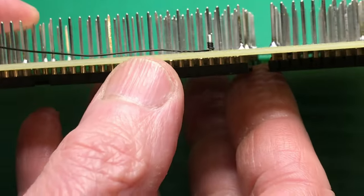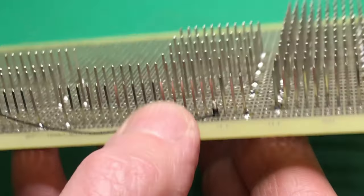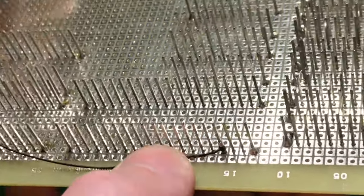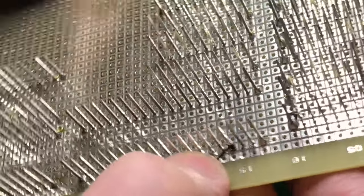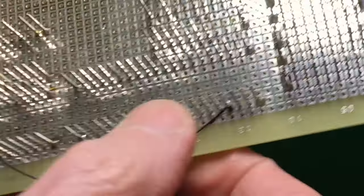And just four turns of wire, which a normal tool gives rather more than that, gives a contact cross-section larger than the wire itself. So again, very low resistance, less than a milliohm to start with, and it may drop over time.